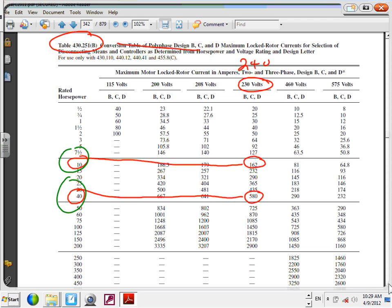guys, the disconnect that you look here, here's what they want. When you size a disconnect like this, they want the disconnect to be able to disconnect the full load amps as well as the inrush. Because that's what we're sizing based on, inrush. If it's not rated to start, like the motor is ready to start here, and you're not supposed to do that, but you want to turn it on from the disconnect, now this disconnect is going to have a huge amount of current going right through it. If it's not rated for this, it could explode. That's what they're sizing based on.